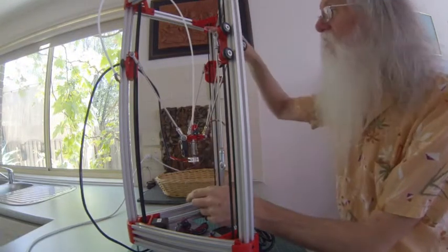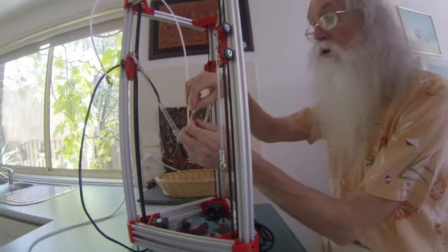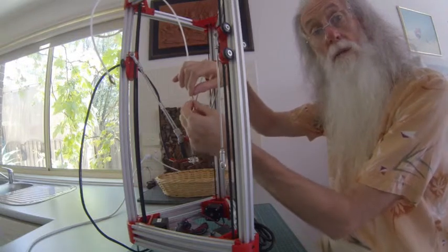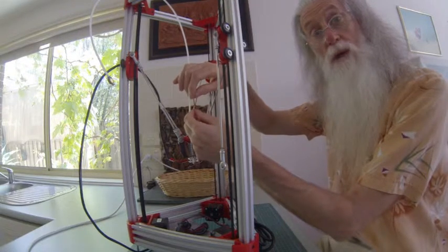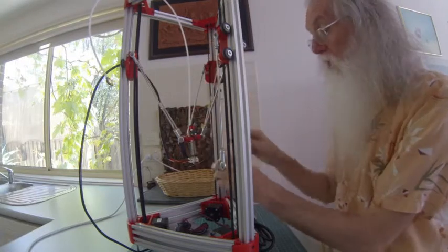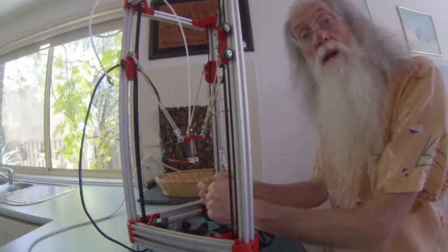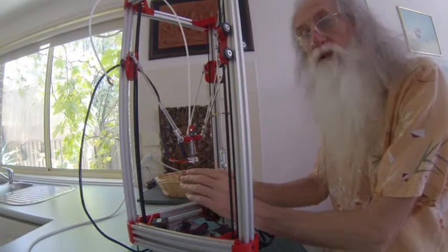Any signal, as in the stops here, will have a yellow connector on it, and if it's a Z stop, I will put two colour pieces of heat shrink on, and I think you'll know what it is. RGB, B is for Z, yellow is for signal. So I'll have the blue and yellow, and no matter where I see it, I know that's a Z and a signal. So if you do that standard in all your electronics, the wiring will seem a lot simpler.